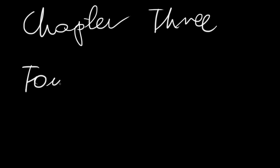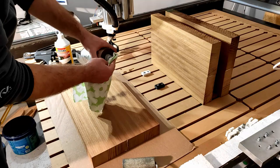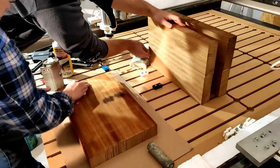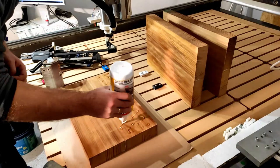We chose polyurethane glue with moisture resistance rate D4. We wiped each surface with acetone and a sponge with water. Following the manual guideline, we applied glue on only one surface and spread it using a stiff roller. It looks like honey, but believe us, the smell is not so sweet.